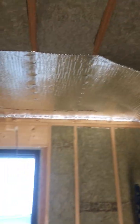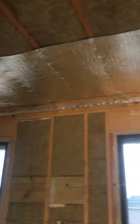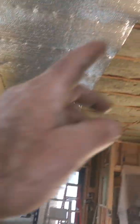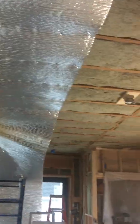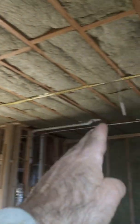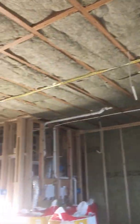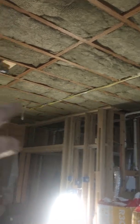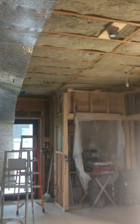That helps the overall insulation seal. We're going to put up a row at a time, snap a four-inch line, and then follow that with the next course until we run to the edge of the room. Then fold down the inch and a half on that side — on all sides, anywhere it meets a corner it folds down and gets stapled off. That's it, just a quick overview on our foiling.